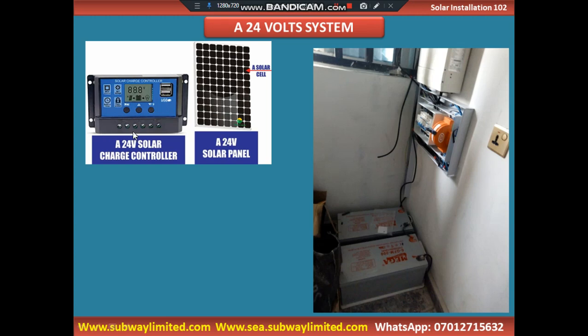So that means if you are using 2 solar batteries, you certainly need a 24-volt solar panel with a 24-volt charge controller. That is the reason this solar panel is called a 24-volt solar panel, because it will be used with a 24-volt charge controller and a 24-volt inverter with 2 solar batteries connected in series. If you connect them in parallel, it will not give you 24 volts. So you have to connect it in series. So that is the reason we are calling this solar panel a 24-volt solar panel.